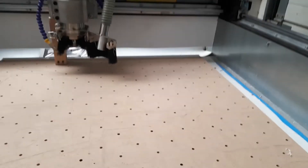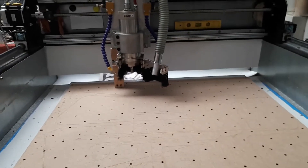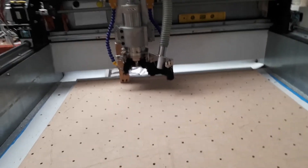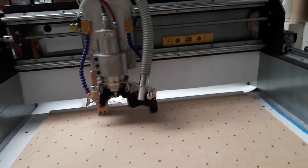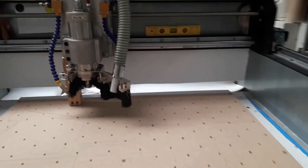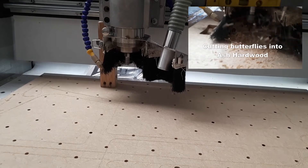In terms of cutting, the machine has been highly accurate. We've done repeat cuts, literally putting sheet after sheet through without any issues at all. The only issues were if I hadn't loaded or checked it properly, or hadn't turned the vacuum on — the sheet might move. These are all operator errors rather than machine errors. Like any machine it will lose steps, but again that's usually down to something I've done.